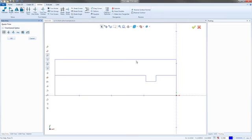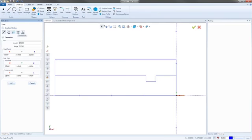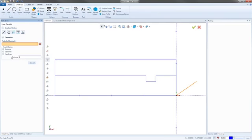The next one, we have to go back to a distance of 10.81. So I'm just going to go to Create 2D, and then Line, and then Parallel. So right here, we just say 10.81. And so we're just going to go from this line straight back 10.81. Now, before I exit this feature, I also want to go all the way back to here and find out where this 25.44 is going to land me. So 25.44 from the front face straight back. And there we go. So this will be the angle that we create.